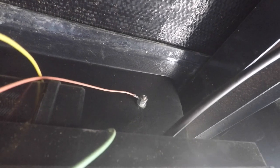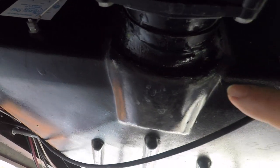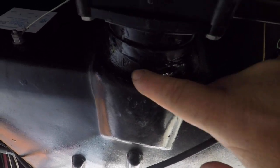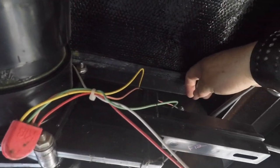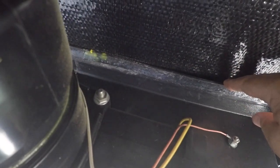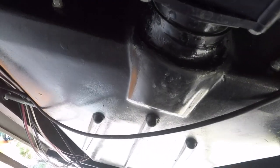You can move this whole thing up and down — it's just flopping. Going down the road, it's constantly hammering itself, and with any liquid in it you've got 400 pounds suspended from this fairly soft tank, bouncing up and down on two little rails that aren't tight. That's bound to cause problems, and that's where most people are getting issues — right in this area and also along the top flange, which can crack or even come apart where the top cap is glued on.